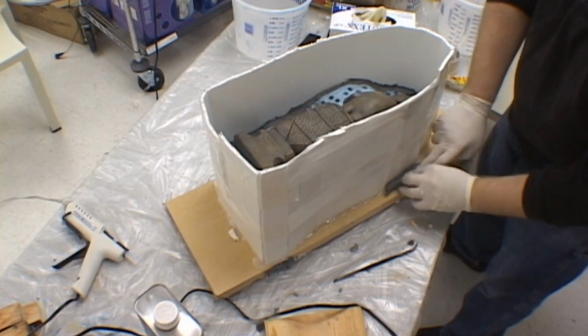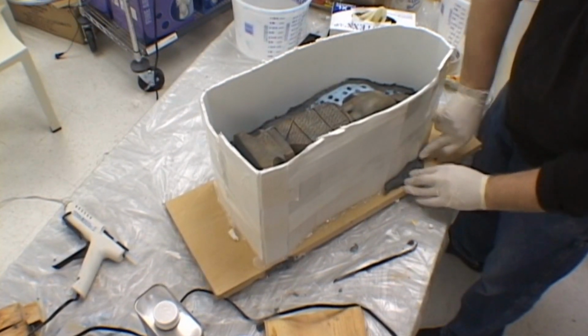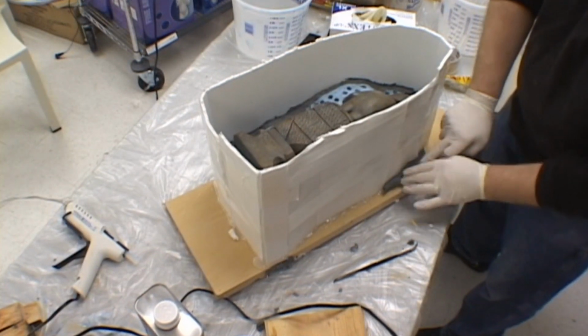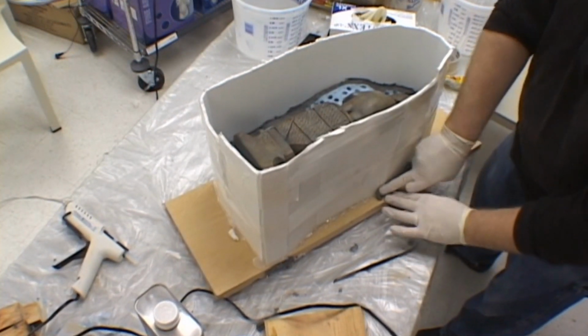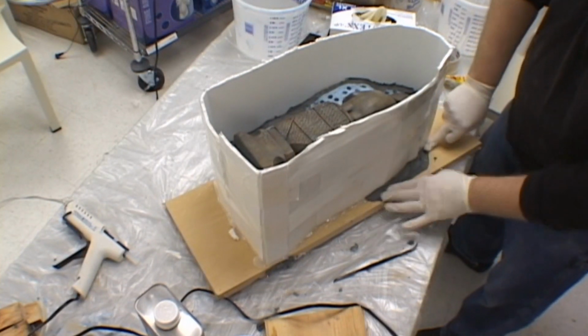As we did before in sealing down the first mold box, put a layer of clay all around the base of the mold box after it has been sealed with a glue gun. Take all steps necessary to make sure that there is no leakage of silicone.